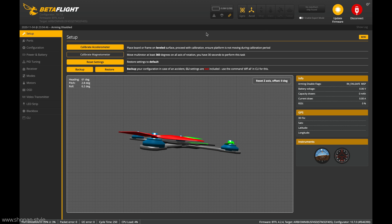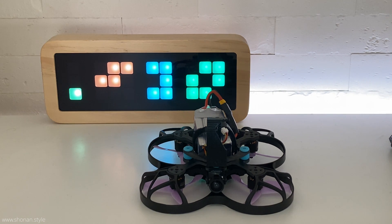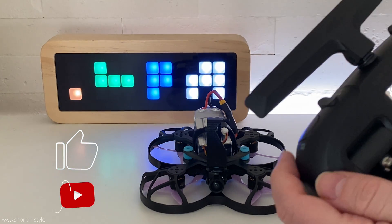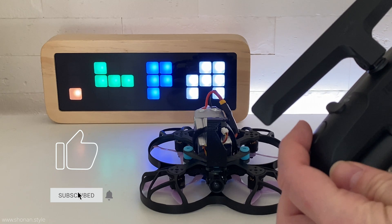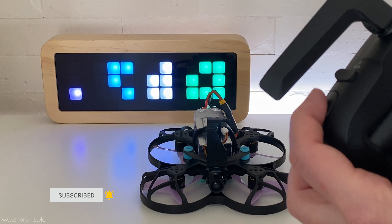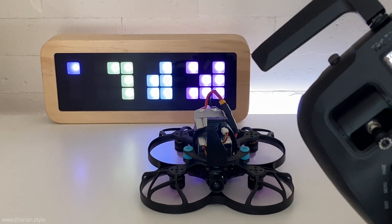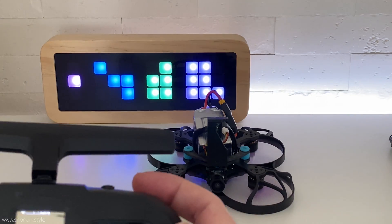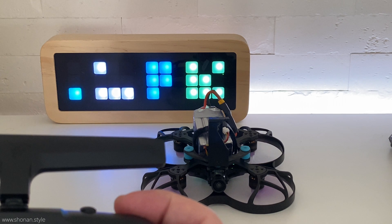Before the test flight, let me show you why I like to have a dedicated switch for turning air mode off and on. Air mode I have on this right switch. When I am engaging air mode the drone and the flight controller wants to auto-correct for something, so the drone gets really nervous even just sitting on the ground. During normal flight, especially during take-off and landing, we don't need air mode — we need that for flips and aerobatics. So it is good to have it on a switch so that we can turn it off.